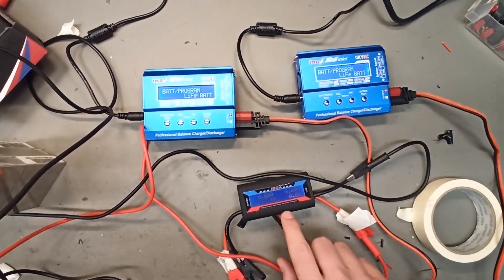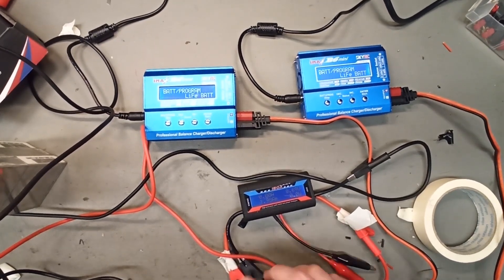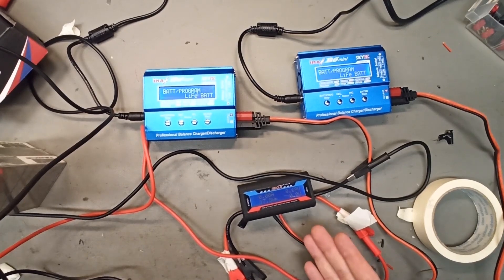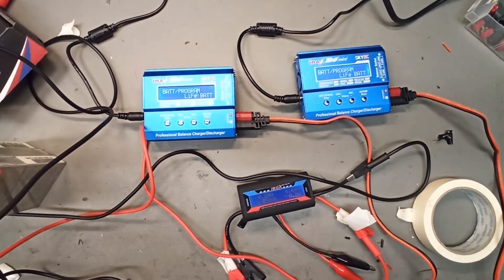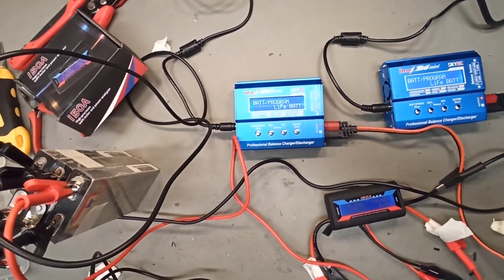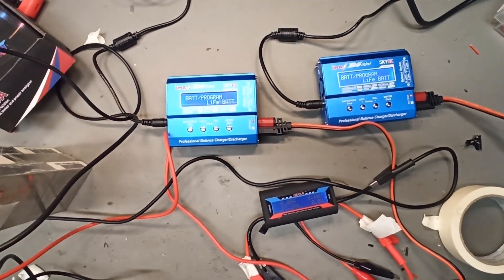It was not the watt meter that was broken — it was me who forgot that the watt meter needs power to run, and it cannot run from 2.8 volts; that's too low. I tried with 5 volts, that was also too low. But then I went ahead and made a 3S 9-volt battery and now it turns on fine.